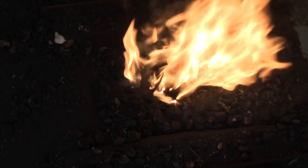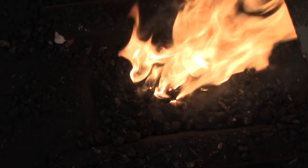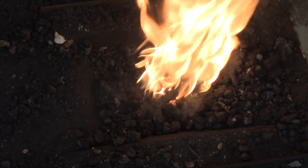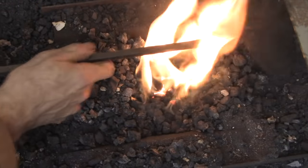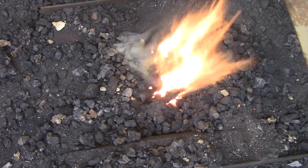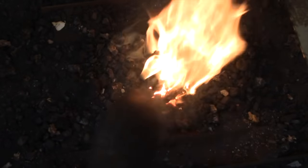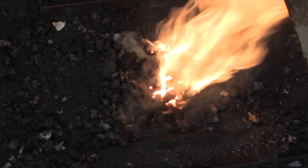When you're forging, the metal is in and out of the fire quite a bit, so you have time to pull out any clinkers that develop between heats. But when you're taking a welding heat, you need a fire that burns very intensely for a much longer period of time, so you want to make sure that fire is as clean as you can get it and that there aren't any clinkers forming in the middle of that welding heat. This is an educational fire so I'm going to let it burn down to show you how the different problems look as they develop.